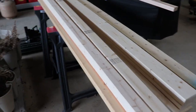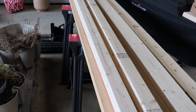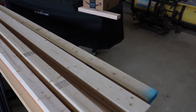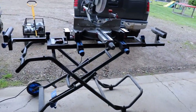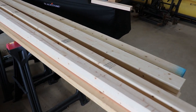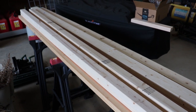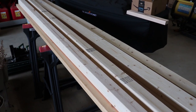All right, what I have here are two by threes, because I don't want a heavy, heavy duty gate. The back gate I'm going to be making is going to be made out of two by fours. What we're going to do is get those all cut down on the miter saw. We're going to cut two of them - basically an eight footer in half - and then cut two more at 54 inches long. Let's get that started.